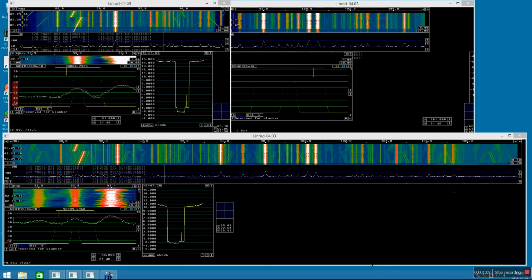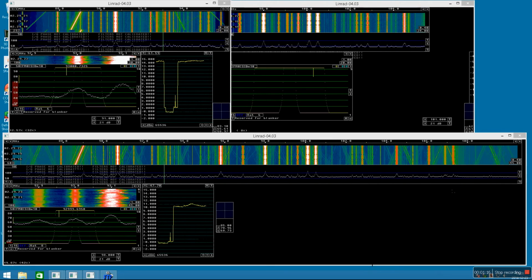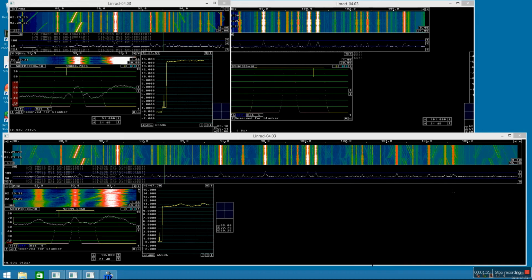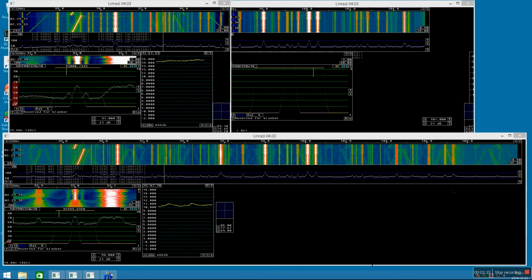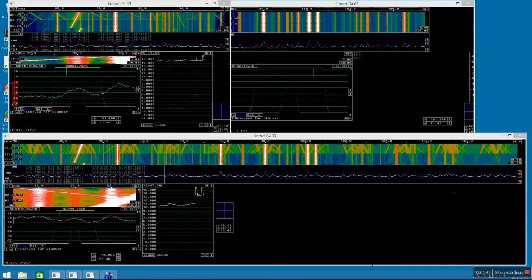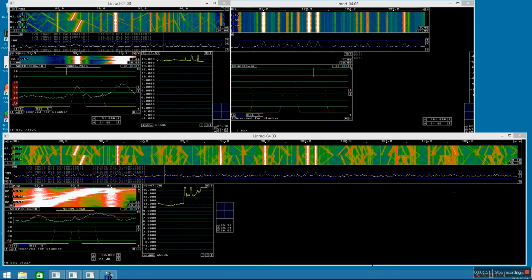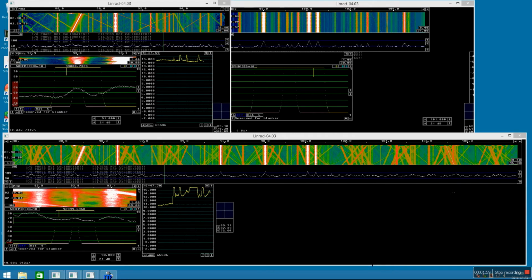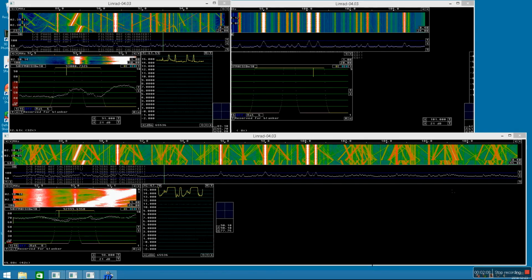And you can see from the S meter that the signal to noise ratio is about 3 decibels better in the AirSpy. And there are also obviously many more false signals in the BladeRF. I can increase the level of the sweeper. I do that by 10 dB now. And you can see we have problems both in the AirSpy and in the BladeRF. But the second AirSpy, which has the sweeper outside the visible passband, is not affected. There is a filter removing this signal.